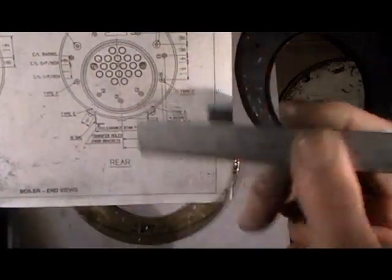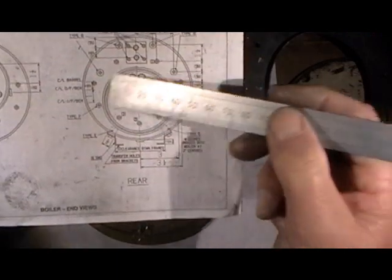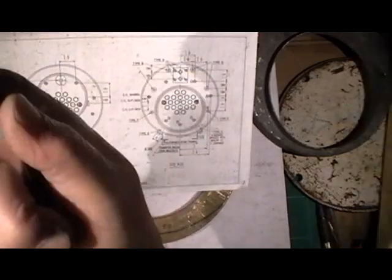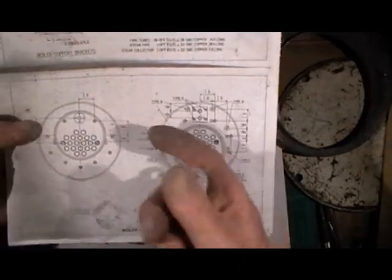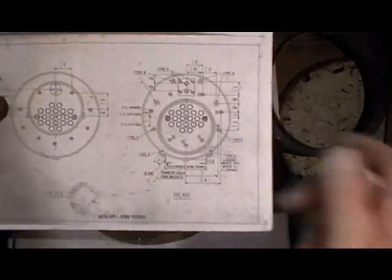Here's me drawing. So this is me backhead flange with an offset at the bottom and a flange at the bottom. This is my throat plate with an offset and a flange at the top. That one's looking that way and this one's looking this way so they're going to be sandwiched together so that the compound flanges both have different offsets and they've got to be inverted so that they come together on each other.